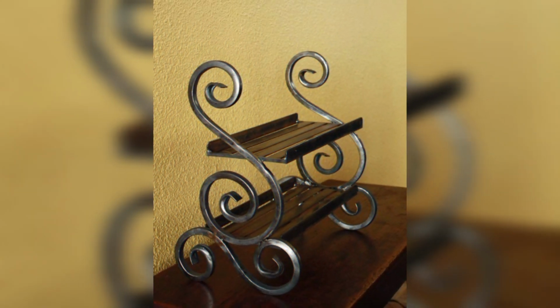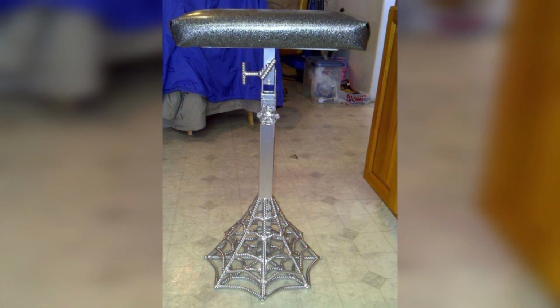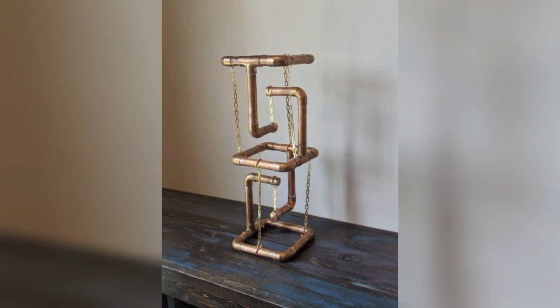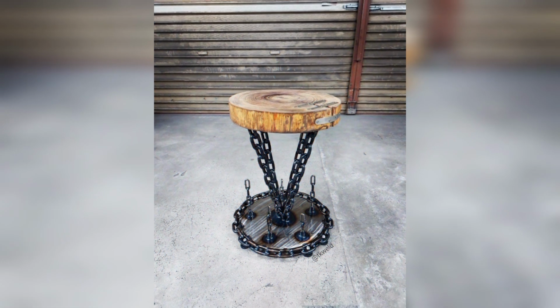So the welding cooling process is carried out either by air or quick cooling method. Cooling through the air weakens the resistance of the steel metal. So cooling by water improves the properties of the steel metal. A reduction factor should be used when air is used for cooling.